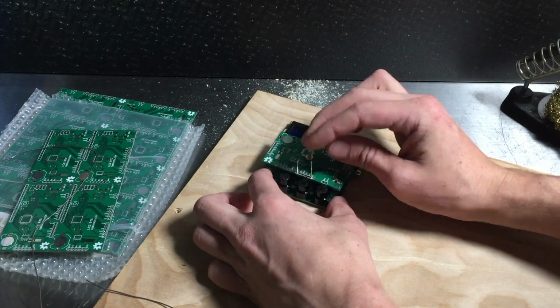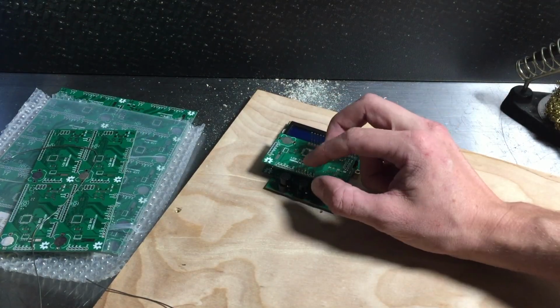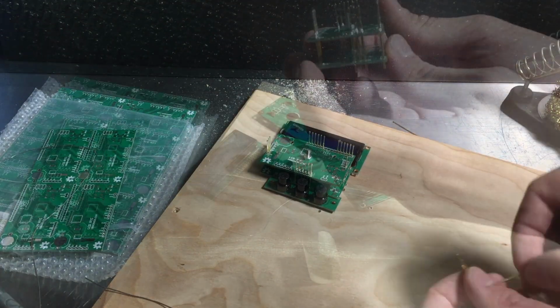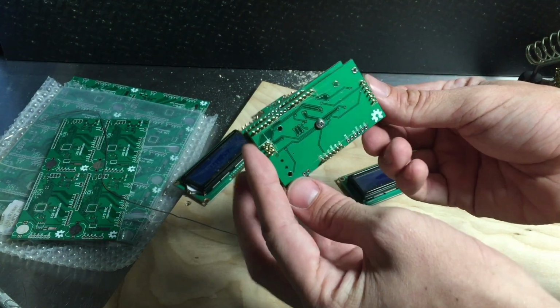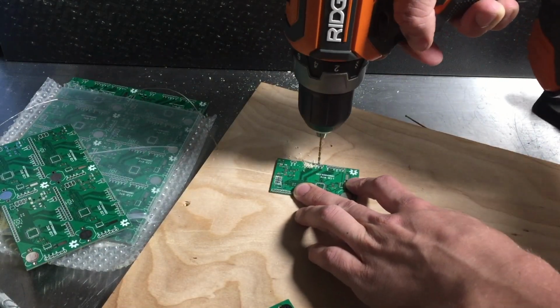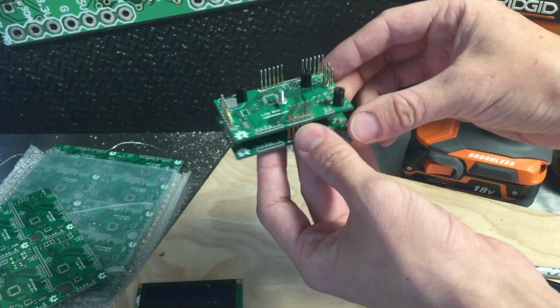As you can see, for our programming and testing jig, we use 3 of the DB LCD RTC Uno boards as our mounting platform. Using spring-loaded pogo pins allows us to easily test blank boards. We solder in the pins to the bottom 2 boards, then drill the holes out of the third, so the pogo pins spring freely in the headers. We leave the unused headers to solder structural anchors.